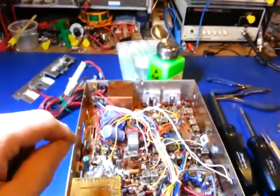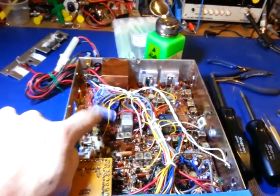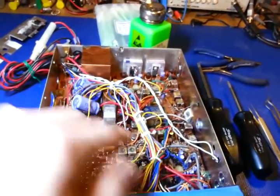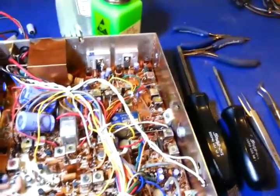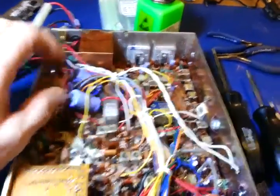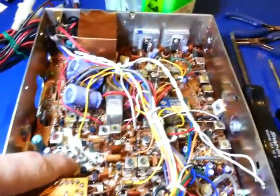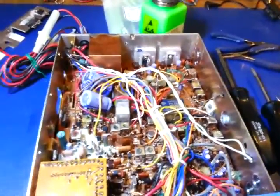The main reason I'm doing this video is to show why you should change these — not just this one specifically, but all of them. This is an electrolytic capacitor. You can see all these little round cans; they're all the same violet-to-blue color, and they're all throughout the radio — all the circuits in this radio — even some of them down here embedded in wax. They're all going to need to be replaced.